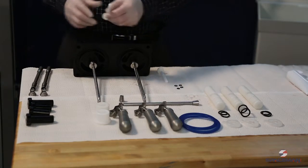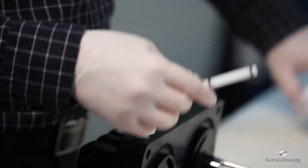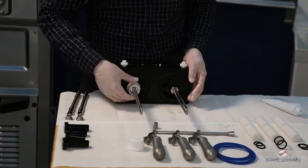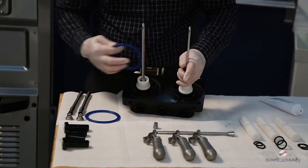Next part is preparing the discharge door for assembly on the machine. We will start with our prime plugs. These little prime plug O-rings on here. Lubricate. We're going to install our rear shell bearings. Install our front bearings in our discharge door gasket.